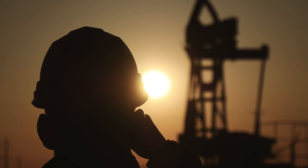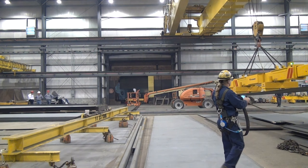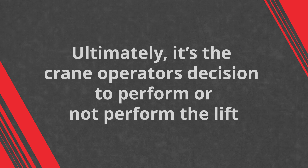There are instances where a designated person is overseeing a certain lift or pick. In that case, that designated person needs to be the one to approve that lift and say it's good to go, and that normally starts with a critical lift plan and a meeting before anything gets picked up. But for the most part out in the construction industry or on the shop floor, when a company deems somebody competent and qualified, it is that person's responsibility to understand sling angles and make the lift properly. Ultimately it's the crane operator's decision to perform or not perform the lift.